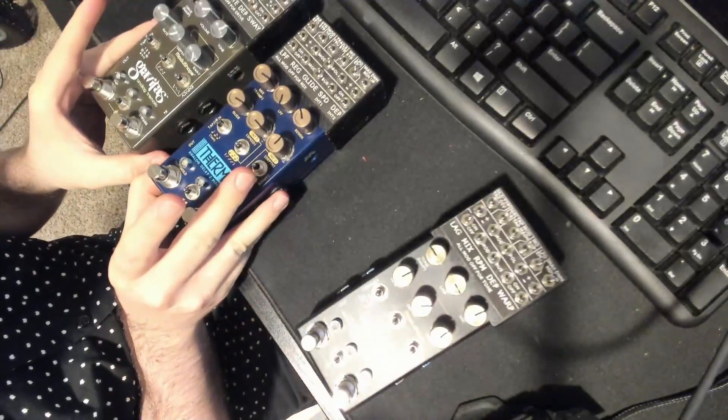Before you affix the backplate, fire up the pedal and use your diagram as a checklist to tick off every switch and make sure it's functioning as intended. Once you're certain everything's working, toss a little conductive tape on the backplate if you want, drill a couple of pilot holes in the bottom, and screw it permanently into place with tiny little wood screws. You now have a fully modified Chase Bliss pedal with a breakout box. A quick overview of the new panel layout: the first row of switches dictates whether a given parameter goes on the modulation bus or gets left alone. The second row contains polarity switches — positive means the parameter goes high when the modulation source goes high, negative means the relationship is inverted. The third row contains global parameters that vary between pedals. All these switch settings can be saved to MIDI program slots and automatically recalled with MIDI program change messages, so doing this mod in combination with a MIDI distribution box can really help you get the most out of the pedal's potential.